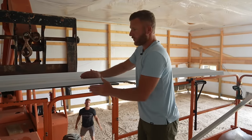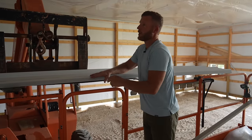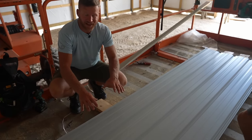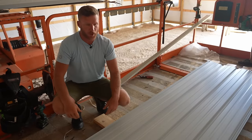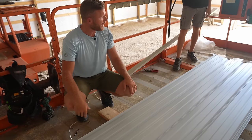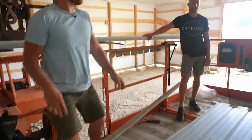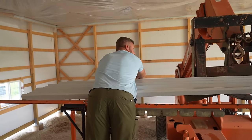The reason we had to do that is we've got a good rib — this is the rib that laps over the siphon rib. We need to make sure it's all stacked correctly. With the sheet upside down on the ground, when we lift it straight to the ceiling we need that good rib going the right way. The control box is up there which I control — it just makes it easier to line up with the trusses. Method to the madness. All right Greg, three at a time.